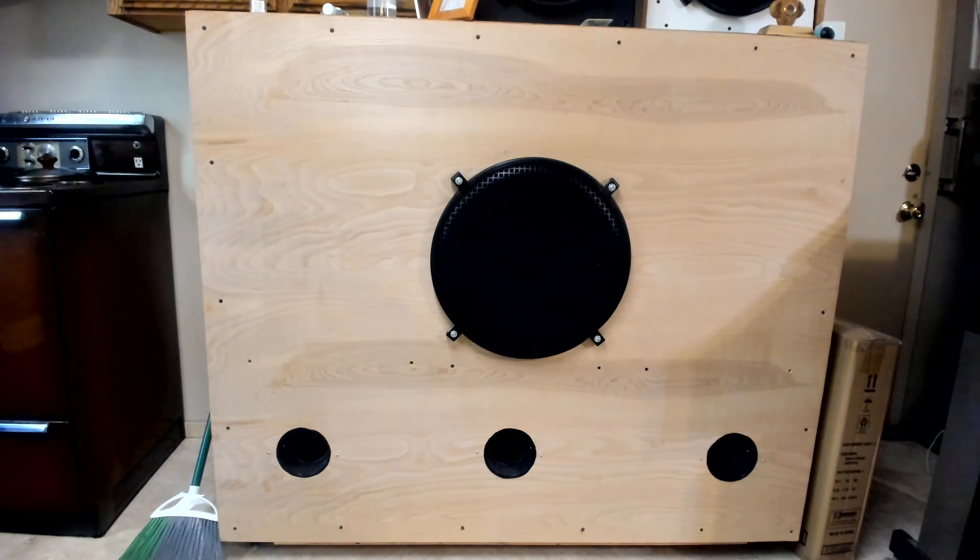It takes very little power to push these speakers — very little power — because they're so efficient. The voice coil and the paper cone are very heavy duty, and they're built really well. I made sure I don't clip the speaker and don't let the power amp clip, and I keep my eyes on the LED level meters on the power amps so clipping does not occur.